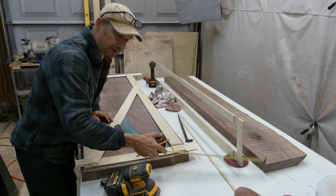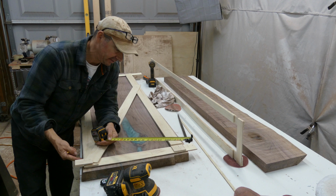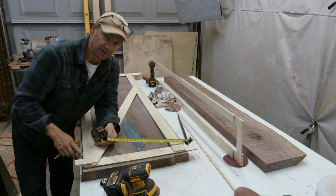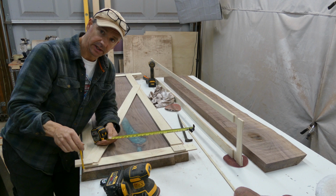So what I plan on doing is cutting the back of this thing flat, and I'm going to screw a 1.5 inch piece of stock to the back of this, probably slap it on with some epoxy and screw it, and that'll hold tight, and then that'll push the slab out, and then I'll drop the 2-inch backsplash down on top, so that'll cover it by about 1/4.